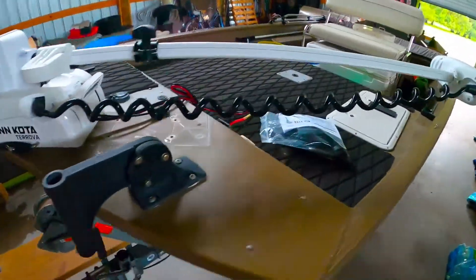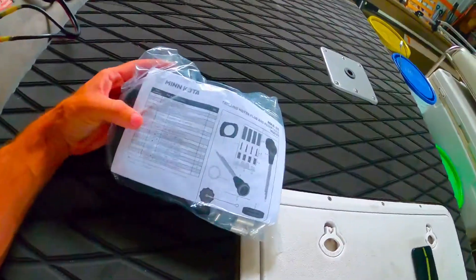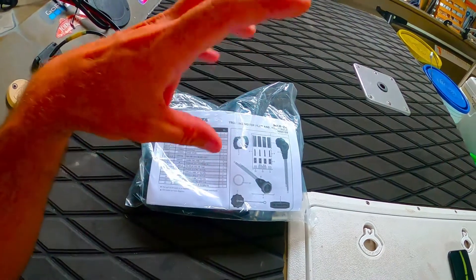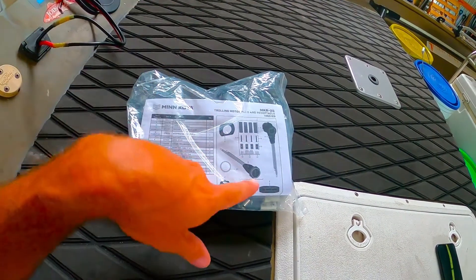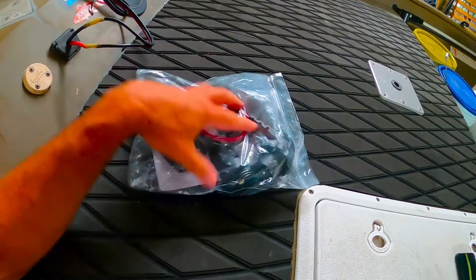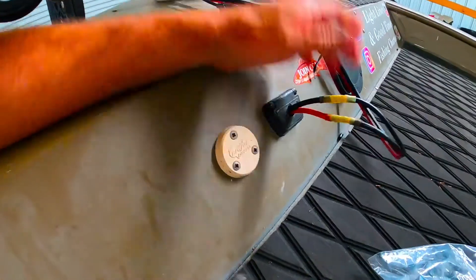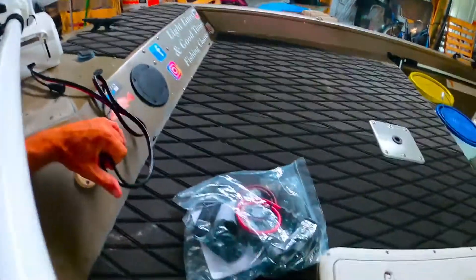Looks really nice. I ordered a new Minnkota power plug and it's expensive — it's like a hundred bucks — but from what I'm reading in the reviews it's well worth it. It has a quarter-turn twist lock so you get a good connection to disconnect and connect it. It has awesome heat shrink ends and all the stuff for it, so it should last. It's pretty heavy duty compared to just having basic connectors. The old plug kept eroding and having problems, so that's why I ran the wire straight through.